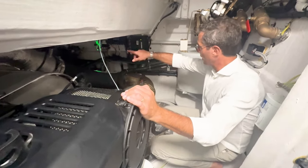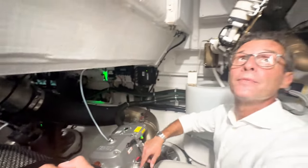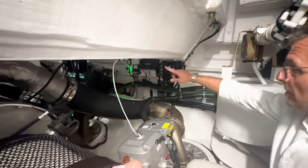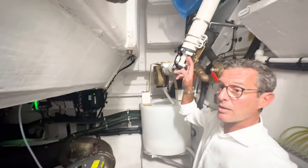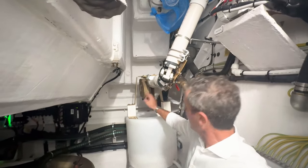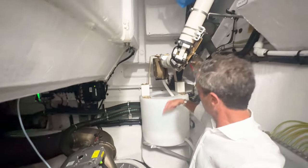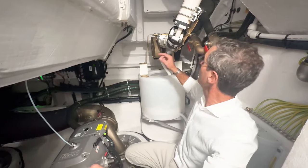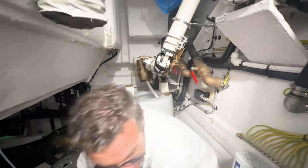Those are all your Volvo electronic systems, and that's your hydraulic unit right there. I could have moved that light and shown you, but that's the hydraulic pack right there, and this is your Volvo steering system brain. These are the Glendinning cable masters, the cables that we talked about before. This is the electric motor right here, which retrieves this cable, goes through these rollers, and comes into this drum and coils on its own, and then comes out and uncoils on its own. So we saw that. Those are the idle bypass of the engines.